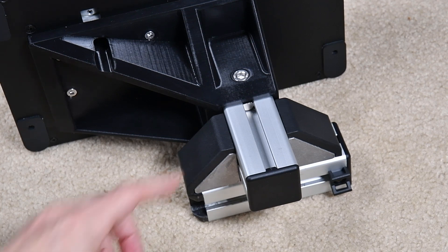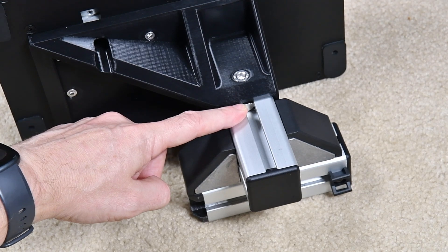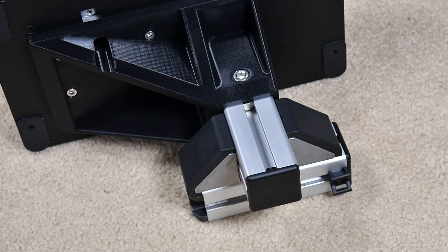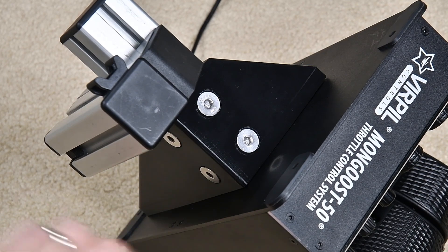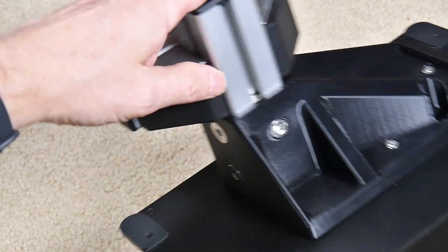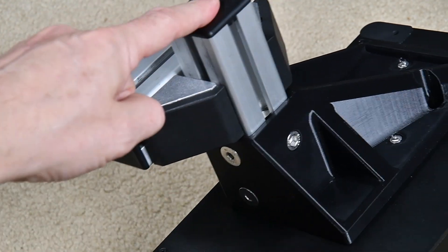The adjustability of this is maintained through these two pieces of profile. The corner braces control the vertical and the horizontal. The two bolts going into the side allow this to slide up and down, and the two going into that profile at the bottom allow it to slide fore and aft. You can also use a larger piece of profile if you need more range of motion. The flight control mount piece bolts in using four M8 by 16 beveled bolts on one side and another M8 by 16 socket head bolt on the other, and that holds it on very solidly.